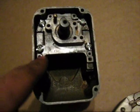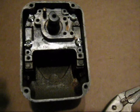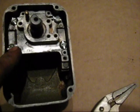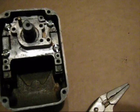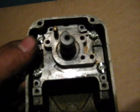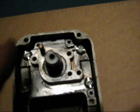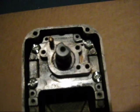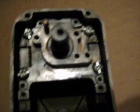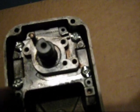I don't recommend putting the original style back in, but I guess you could. If you buy these from the hardware store, they're very difficult to find — it's a number 12 by 24 thread. It is a standard size 12, just above a 10, and it was very tricky to find. There was one box in the entire hardware aisle, and in that box there was one section with only one size: 2 inch. Which worked out because these are 2 inch. Those were 45 cents a piece — there's one way to save money. And they have the ability to take it apart again without ruining anything; those are slotted or Phillips.